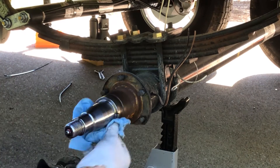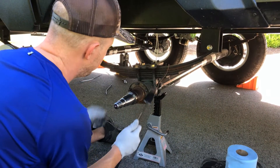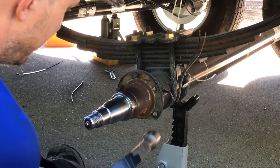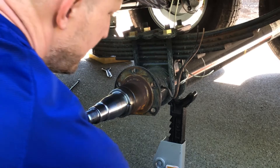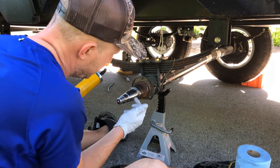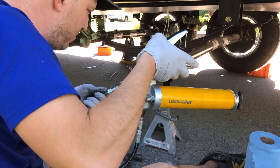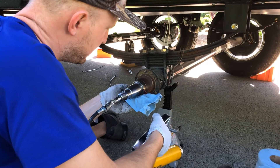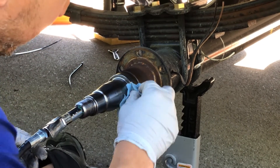I'm going to wipe this down several times to make sure there's no gunk in here. The next step is to remove the five bolts — the kit includes five new bolts — and they just hammer out easily. One step I think a lot of people might not think about, especially on easy lube systems, is that there's still grease in the zerk passage. Since I'm using a slightly different type of grease, I'm going to pump a couple of strokes through because my greases are different colors, making it easy to confirm fresh grease is primed through the system.